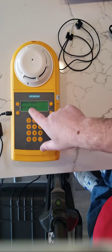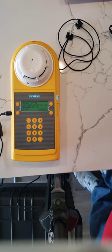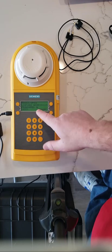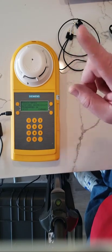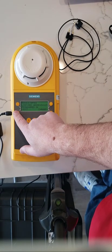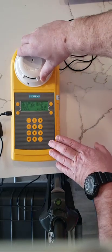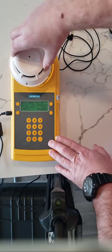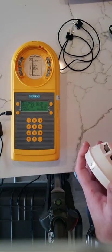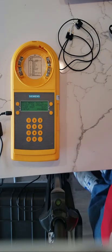It's going to identify the device, which is FDO421 or OP921. Once programming is done it's going to say 'Program OK'. Before we remove the head, we have to click exit first, and then we are allowed to remove the head. The head is now programmed into loop number two, device 129.